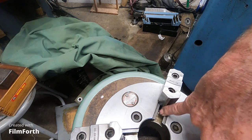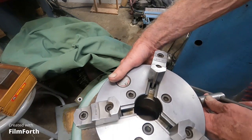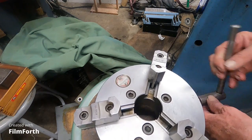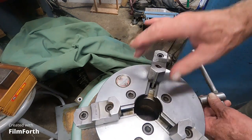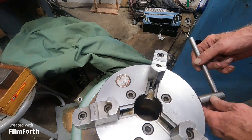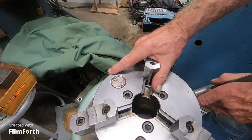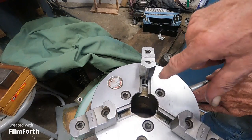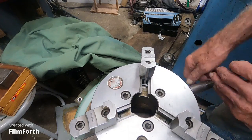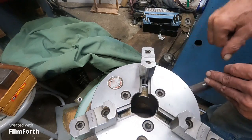When that wears more than three-thousandths of an inch, you're going to start losing repeatability — more than three-thousandths inch play. When I redo these, I do it two thousandths or under; you've got to have some clearance. Usually when I repair these, they say it's bad — like five thousandths. To repair that, you have to take it apart and sleeve that bearing surface.